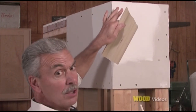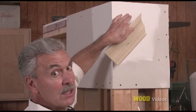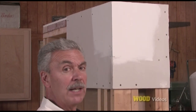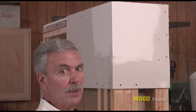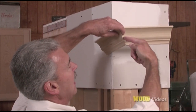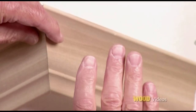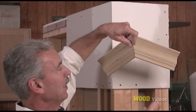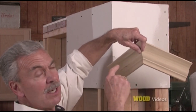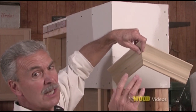After this all sets and the glue is dried well, you can sneak nails in a little bit closer, and any irregularities on the other side are going to be taken care of by caulk, just like we talked about before. And lastly, resist the urge to put a nail in the side to hold these pieces of trim together. In many cases it may work, but ultimately you're going to have a nail that blows out through the side of the trim. Trying to friction that off, the dents and the holes it creates are just not worth it.